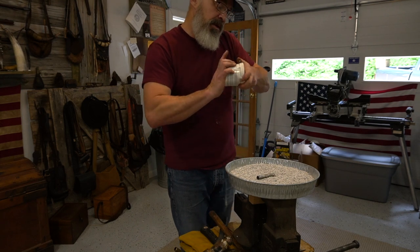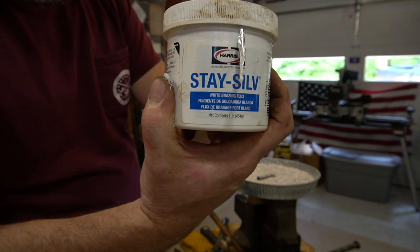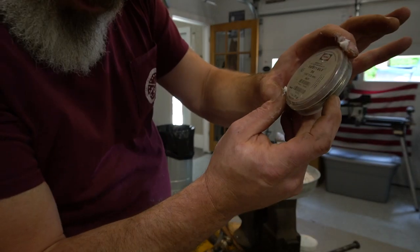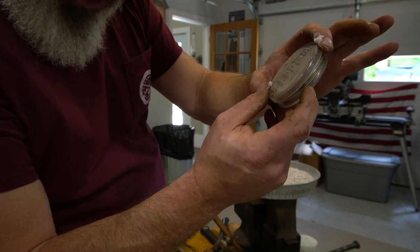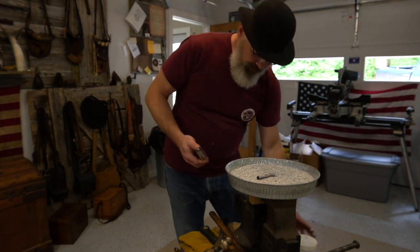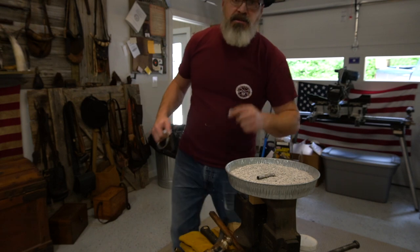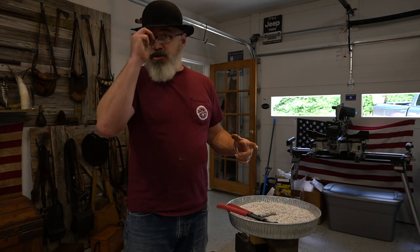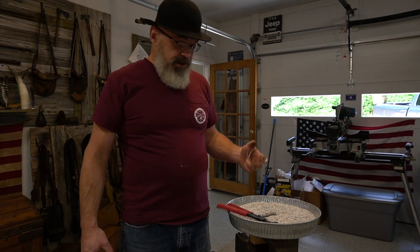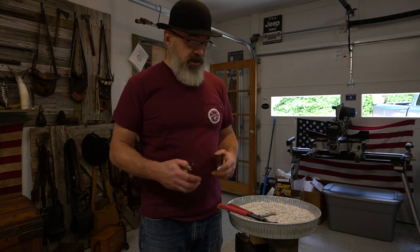What we're using is StaySilv white brazing flux — this is a good silver brazing flux. Then we will use some SafetySilv; this is 1/16th inch, 56% silver brazing alloy. This is much harder than soldering — this is what I like to use for my sights and anything like that. It's a good way to get a strong, strong joint. Full disclosure — I haven't done this hundreds of times like a lot of the guys on the ALR forum. I've done four or five of these, four or five sets of ramrod pipes, which is a similar process. So if I fumble around a little bit and look a little goofy, that's why.